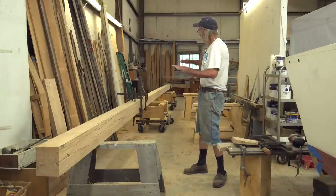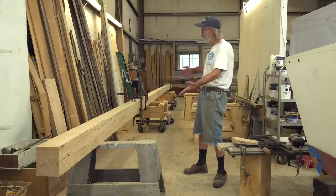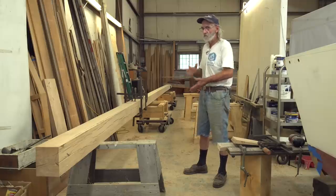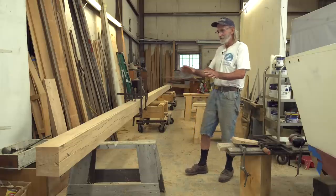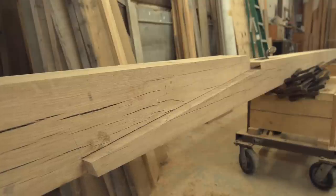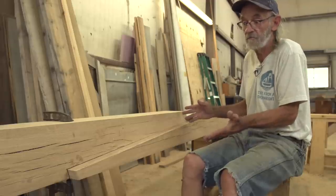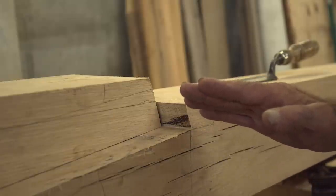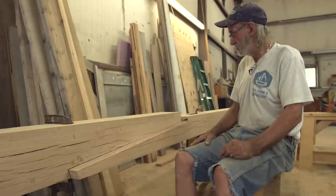This is the keel for Orca right here - the two timbers join together. The boat's got 4 feet ahead of that and quite an extension behind, so the boat's going to be 40 feet. This thing is like 32 feet or something like that right now. This is the type of work I really like to do. The scarf that I made is right in there - I've separated it a little so you can get a look at how it works and how it fits. Here's that undercut I was talking about - it's tilted back like that. So when I slam it up tight, this piece is stuck underneath this piece, and that's what stops the end from rising up and down.